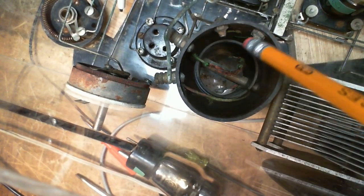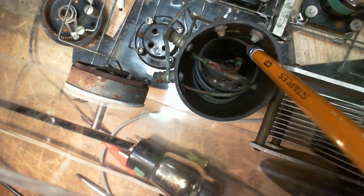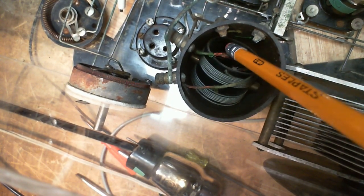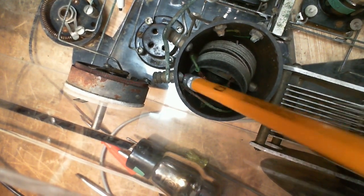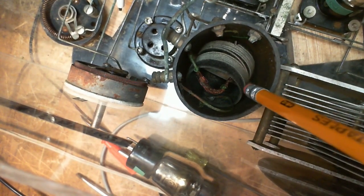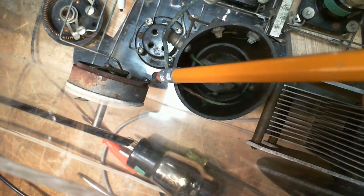And we have the rotating coil here, which we can rotate. See, it's a split coil. You have to split it, I think, to get around the shafts that are in the side of this thing. That's all it is. You can clearly see the terminals come here. This is the long wire to nowhere, and this one is clearly coming here. Now, nothing else is hooked up to these terminals. So this rotating coil is all by itself on these two terminals.